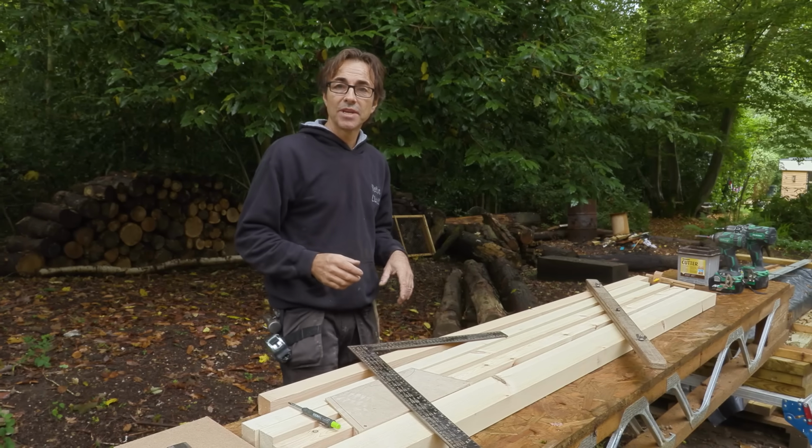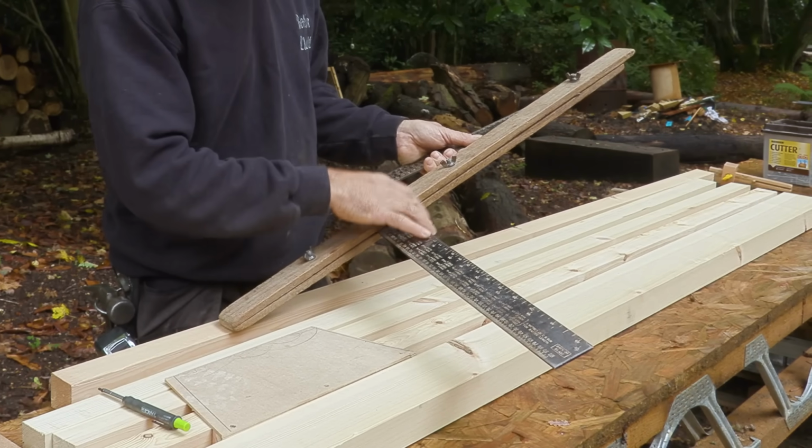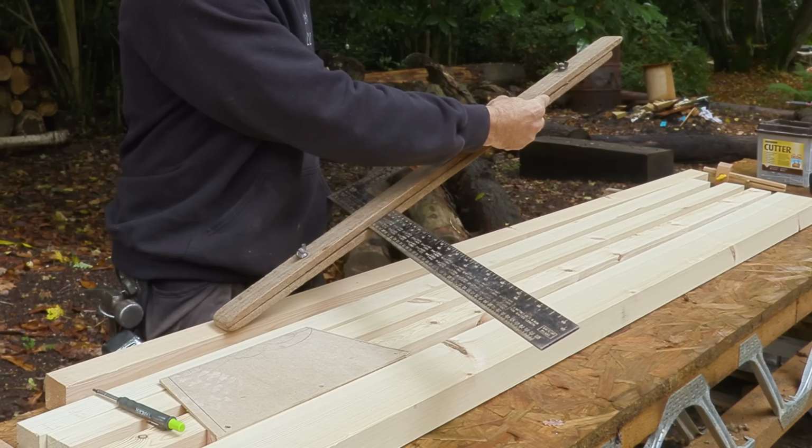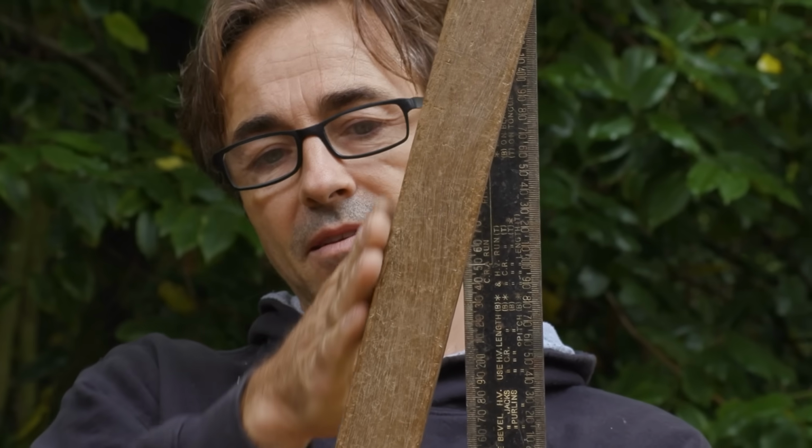It gives you a nice narrow footprint, so when you're working around your trestle, you're not going to catch your feet on it, and so it works really well for me. I set my fence 15 degrees by my striking point, which is here. Tighten my fence off. That's roughly the angle that the legs will travel at in two directions.